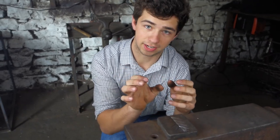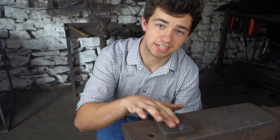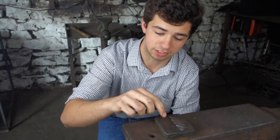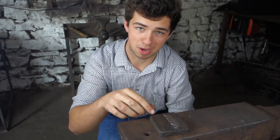So what we're going to do is get that piece of rectangular bar. It's 30mm wide by 5, and we're going to section off a little bit and make that into a long spoon shape, and then hammer that straight into here. This way we don't have to cut the oak leaf profile before, we'll do it after, so it matches where these deeper veins are. What we should really do is get a laser cut or plasma cut of this shape made, and then make a tool to match the shape. That's probably the best way to do it, but this way is a bit of a cheating way, I suppose, as we just punch veins in the entire thing and then cut it all together. But anyway, let's get on with it.